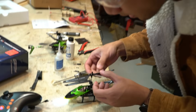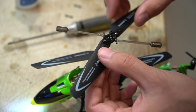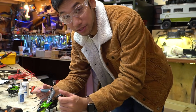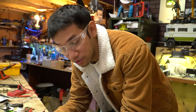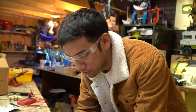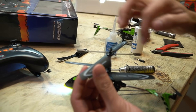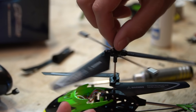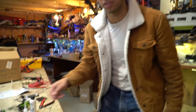I don't understand why they specifically attach the fly bars to a separate set of pivoting linkages — it seems more complicated. I think it's just because people have been doing it that way for so long, and most of these toys from China are rehashes of other designs. I've attached the fly bars — these weighted things — which will control the pitch of the blades at certain parts of the rotation. I think this will work and it definitely simplifies the parts list.